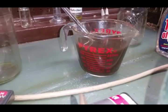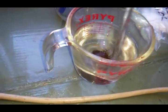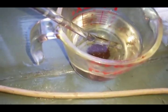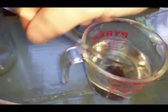I'm gonna let this sit for about 5 minutes, then I'm gonna show you what it looks like after that. If it's all settled, then it's a good drop and there's a lot of pure gold in there. Alright, so I said a few minutes, but it's actually been overnight. The gold with the sodium metabisulfite was taking forever to drop. It was suspended in solution, but wasn't going to the bottom, so I actually used a little bit of iron sulfate in there, just a little pinch of it, and then dropped all my gold right to the bottom.